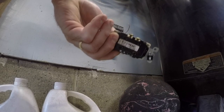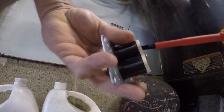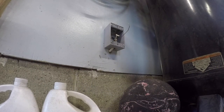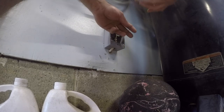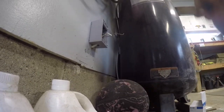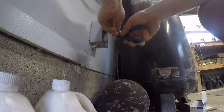Now that that's off, we'll pull this one up here. She's got screws on the bottom. Green is ground, boys. We got copper for black, and we got shiny for white. Holy frick, that can't get any easier than that. So we'll stick the old ground in here first. We've got to get some pliers to straighten that thing out. Straighten out the old ground. Make sure she's not cobbled up.